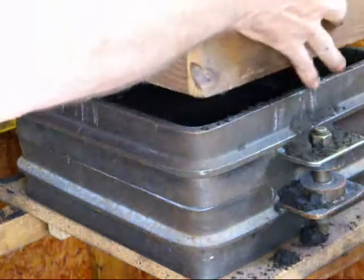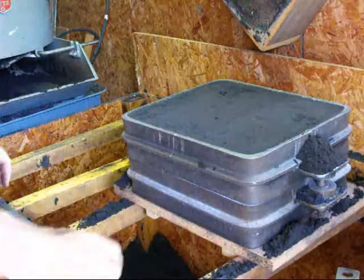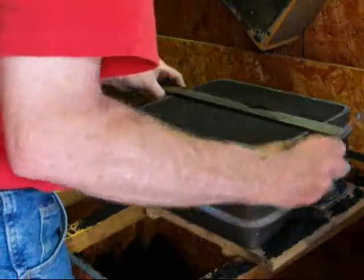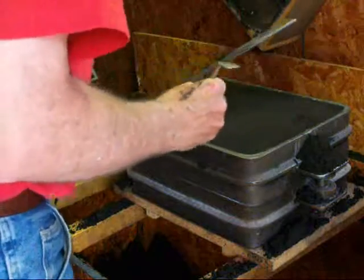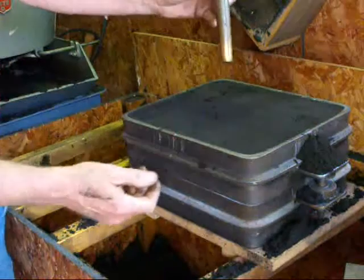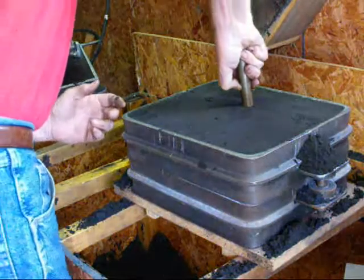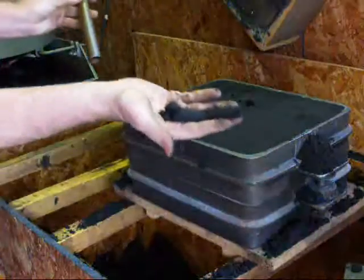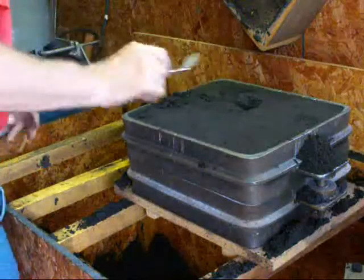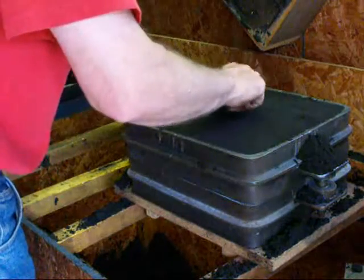Since this is a bit of a repetition, I will wrap it forward to the next section. The second half has been rammed up, smoothed, and struck off. Now I'm looking at where my coordinates are to put my sprue hole, and I'll run a line across there. This is the sprue cutter — we want to go down just halfway. I'll use my thumb as a stop, push it down, and out it comes. Take your spoon and make this into a little funnel so it's easy to hit the hole. Pack that down with your fingers so no loose sand falls in later with the molten metal.